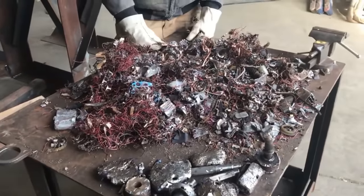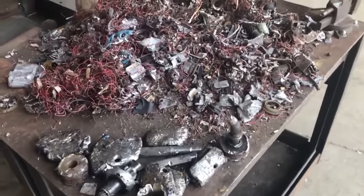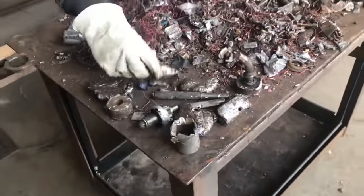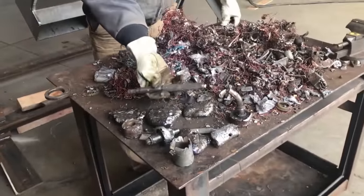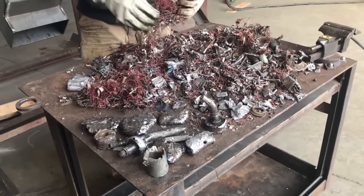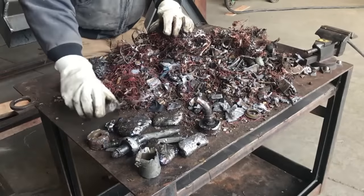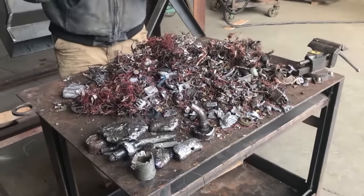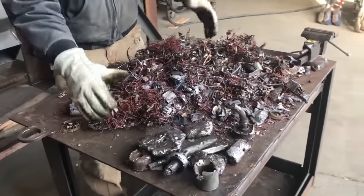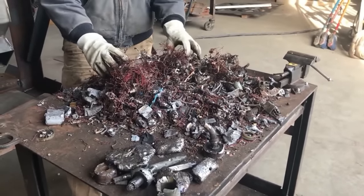So here are those two alternators and starters that we put in. And really the only reason to pre-shred those is to take out this big steel. These big pieces of steel really hinder your ability to finely shred this up and liberate the copper and the steel. And so by pre-shredding, you can liberate all this big steel, have someone on a picking conveyor picking it out, and then have all this stuff go through one of our smaller scrap lines with a much smaller screen,